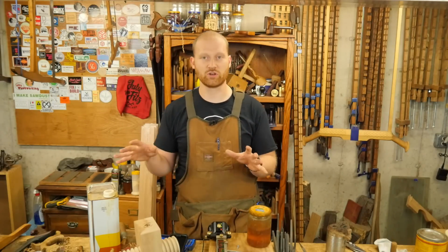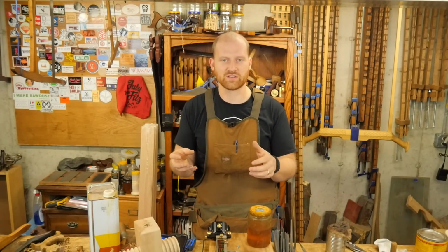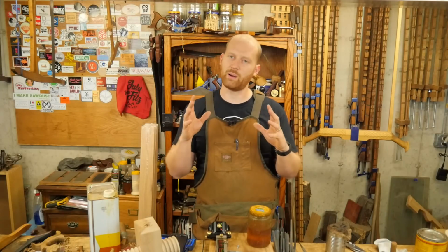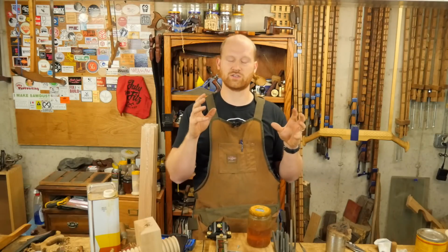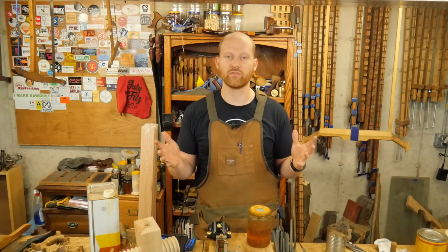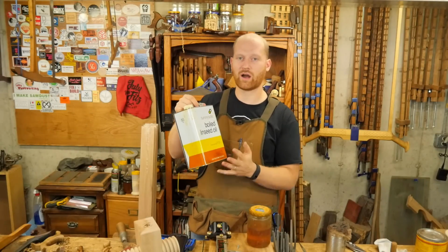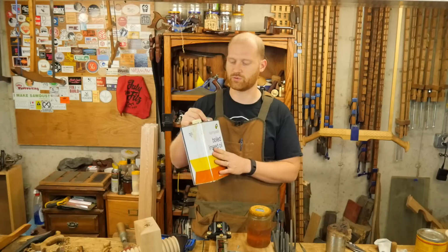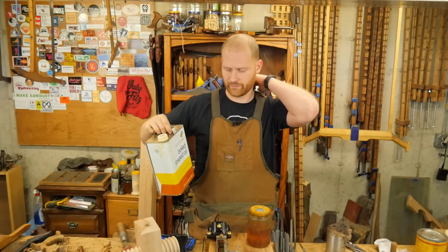And that is really kind of what you're looking for with the wood. The oil seeps down into the surface and then hardens down underneath, and that's fantastic. The problem is with regular linseed oil, it just takes forever to dry. It can take months to slightly harden. Whereas if you put a chemical dryer in it, 24 hours later you can get a nice surface on it, and the surface can be nice and smooth. And in the course of a couple days you can get hardening all the way through it.